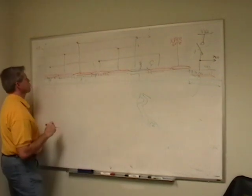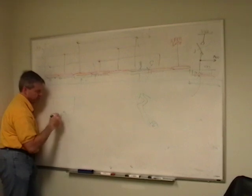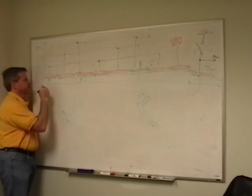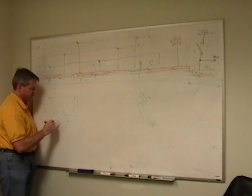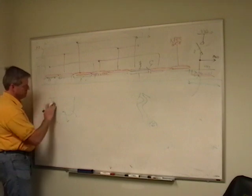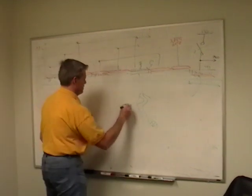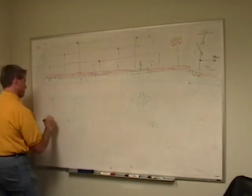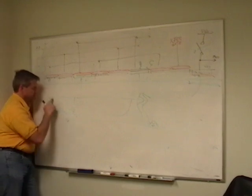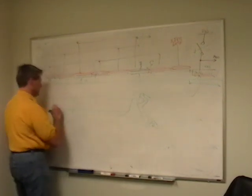And then what you also get in these layers, in these potential wells, is you occasionally get an electron that wants to get out. And there's a way that you can get around that. It's called a buried channel. So you dope the heck out of this thing, so this is like P plus, and you'll dope this whole thing down to N minus, right? So now I dope my whole thing from P plus. I'm looking at it this way. So my whole wafer is here, and this is P plus, and then I will dope this down to N minus, or maybe even N minus minus, and then I will come back and I will dope this back to P plus, or even P plus plus.